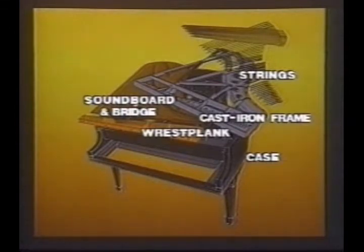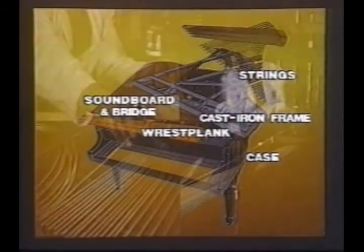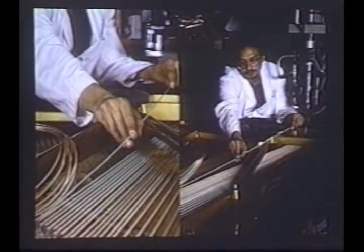The traditional method of stringing by hand is combined with modern technology. The technique of overstringing the bass, a process perfected by Steinway, uses another innovation, the tuning pin placement machine. The stringer inserts a wire through the becket hole in the tuning pin. Then the machine turns the pin to put 3 perfect wire coils around it and drives the pin into the rest plank with even force at the precise angle.